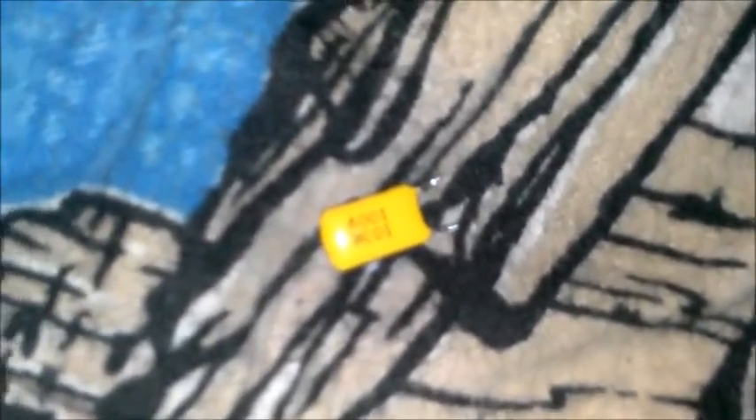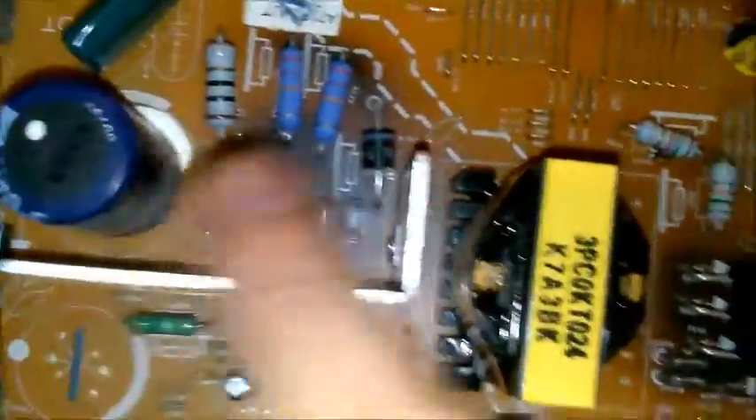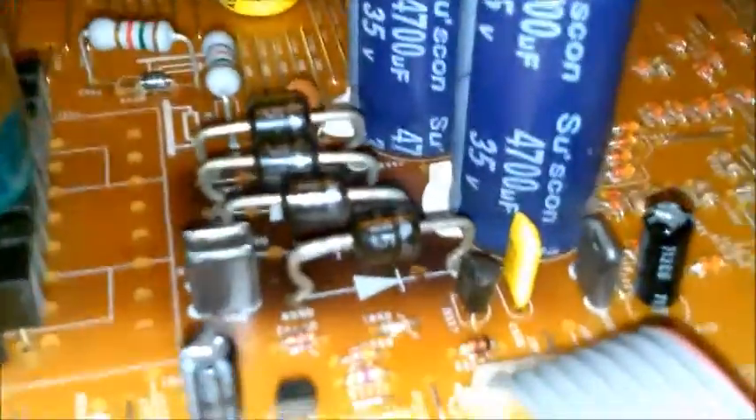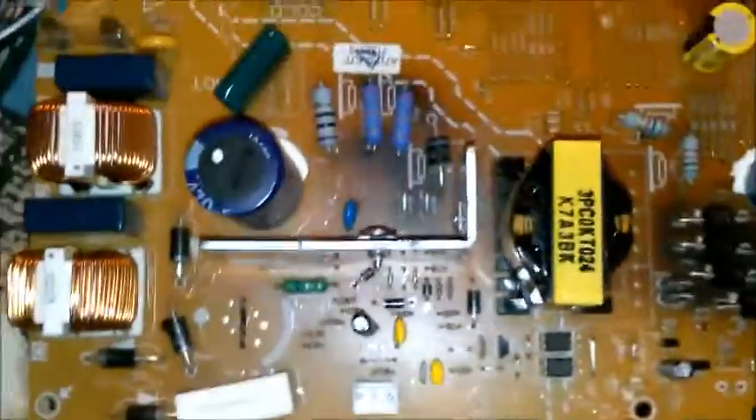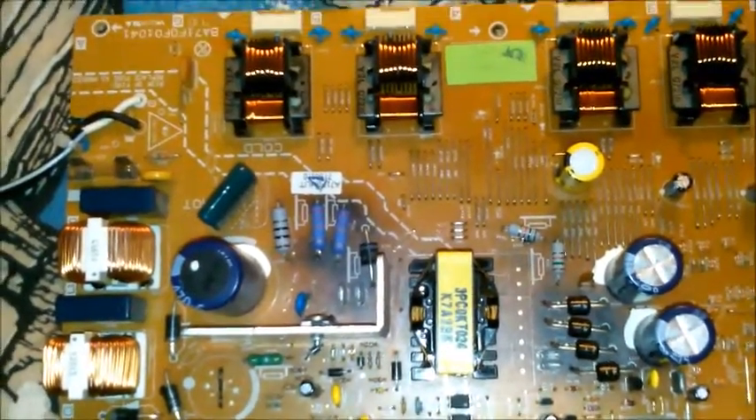Another little follow-up: we have replaced some more parts. Here's that one bad film cap - replaced. I also replaced these other two that tested out of spec. The electrolytics were okay. There was one questionable electrolytic - a 470µF 35V - which I replaced, and it measured spot-on. Of course the big resistor is replaced. All the other electrolytics I tested were okay; the big filters were fine. The diodes - even though the board's been cooked - were still working. I'm about ready to slap this board back in and see if it's going to catch fire or if my TV is going to come back to life.